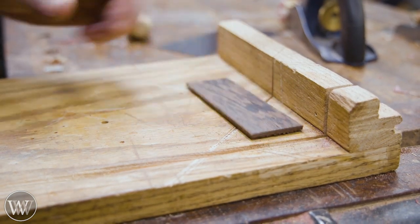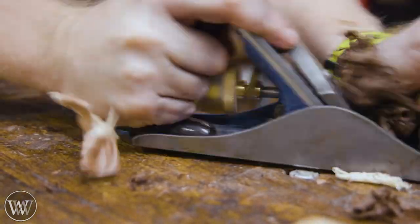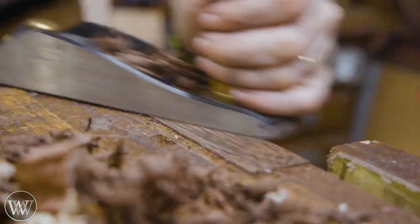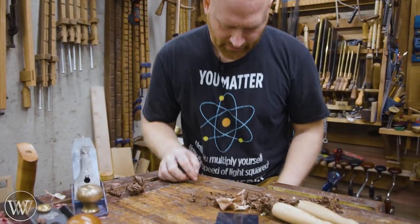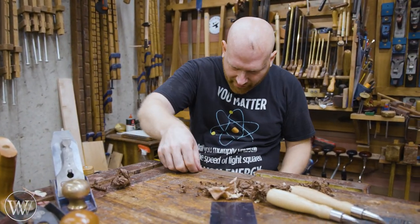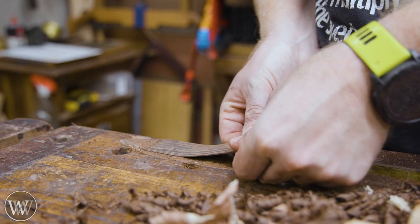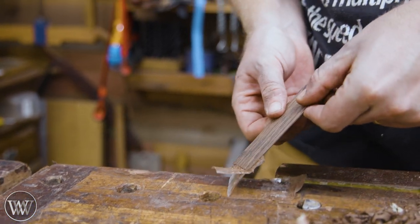So we're going to do this again, but this time with just simple scraps. These are some other pieces I have lying around. This one was about an eighth inch thick — it's a dark zebra wood — and they're pretty straightforward. Just tape it down to the bench and plane it down. I took it down to about a thirty-second of an inch, and this one peeled off a lot easier.